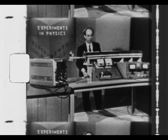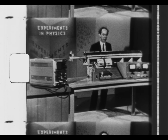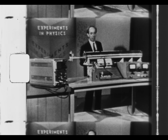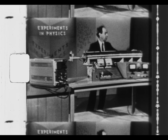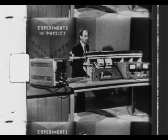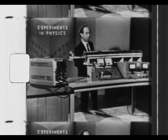You can also connect the layers in series, but then you have to pay attention to which way the current is going in each layer if you're going to make sense out of the results. You can count the number of turns per centimeter on this particular coil; the total number of turns is given, so you simply have to measure the length in order to calculate the number of turns per meter.